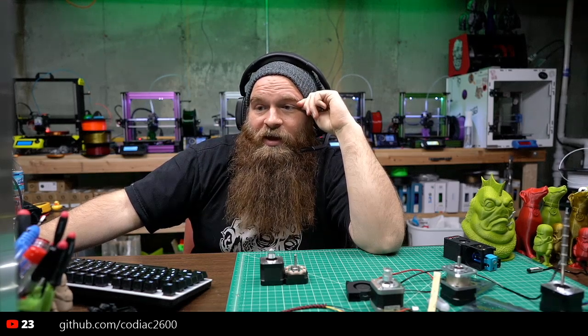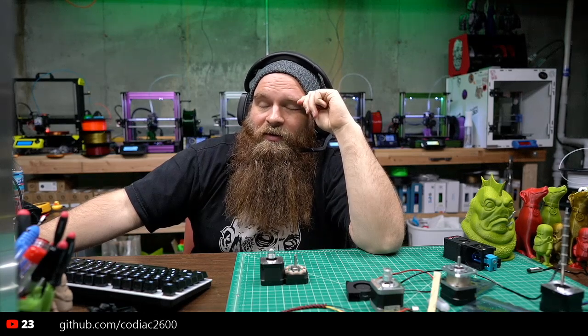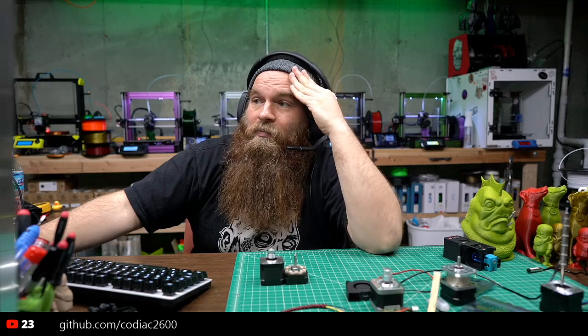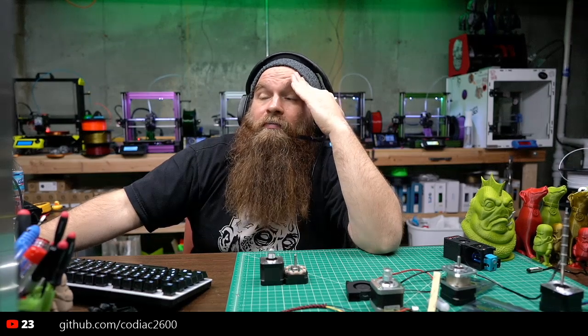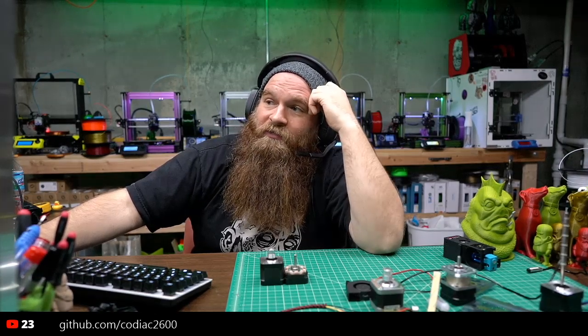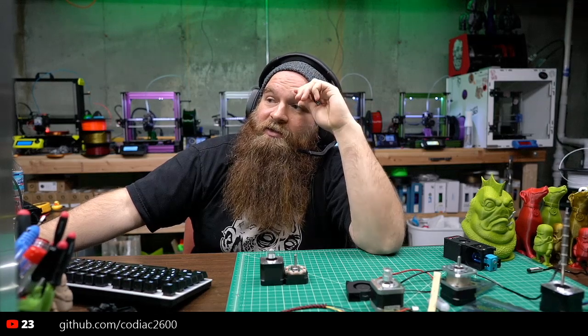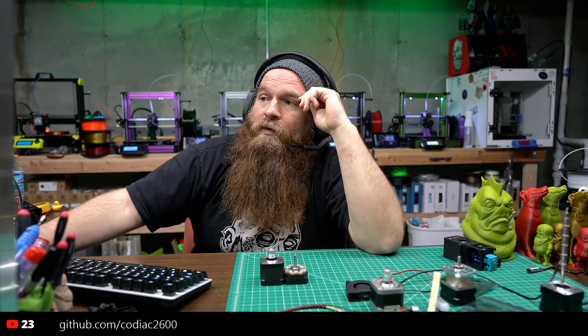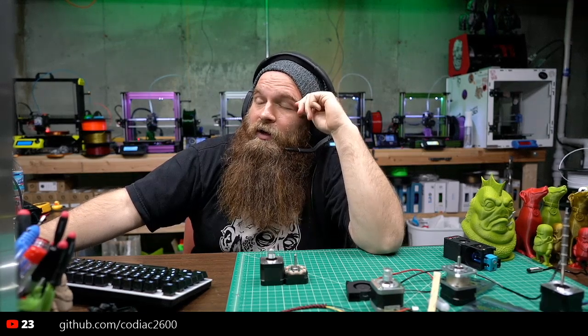No, Techie Dad. You cannot use just a regular PWM pin. You need a strong 5 volt. So if you have an SKR 1.3, the only way to do it is to steal the 5 volt from the servo, because you need a dedicated 5 volt. PWM won't run it. You'll blow your board if you try to run it.